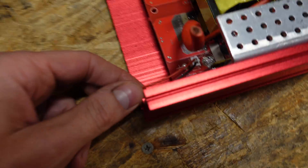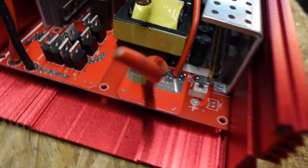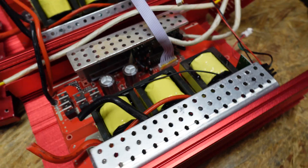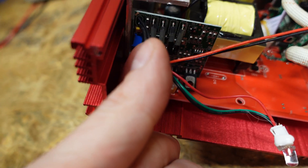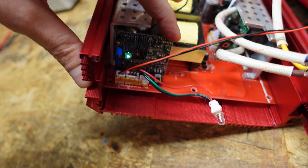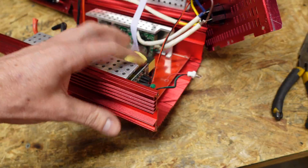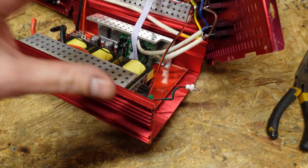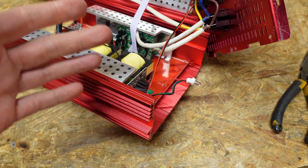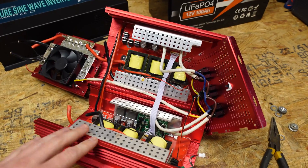Let's see where the fan controller is. The plug for the fan — I don't see a controller down in there anywhere. I don't see a FET transistor or anything. In fact, I don't see any temperature sensors anywhere. This little green thing here is a temperature sensor — it does say NTC1 on the circuit board, so that must be the control circuit for the thermal. I don't see any more of those anywhere — none on this board, none on the heat sinks. The fan itself works fine — if you apply 12 volts it spins. So it must be the control circuit. If that's damaged, other safety features that are thermally reliant might also not be working, because this case got really hot before I caught it.